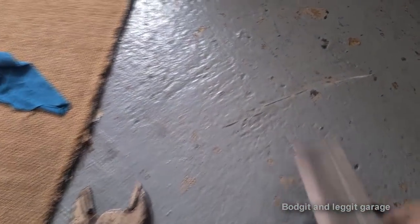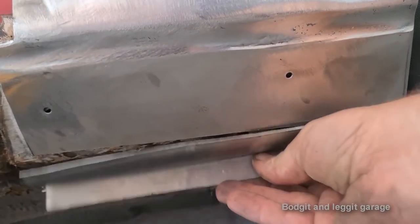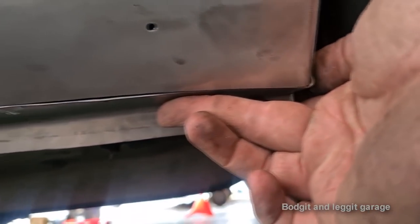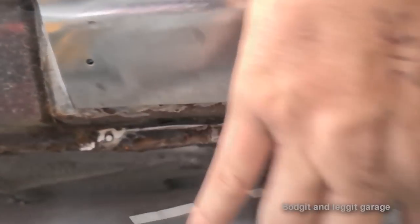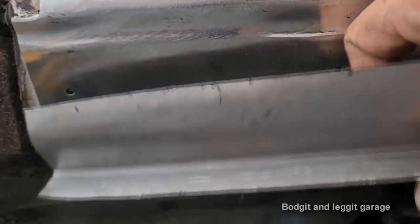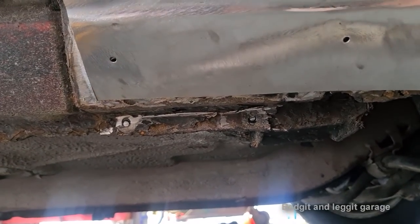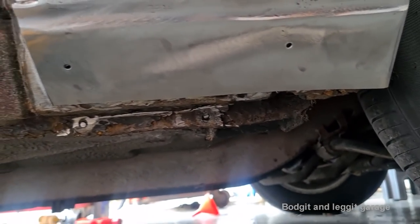And now, when we come under here, I do this, look at that. So once I weld that all the way across there, I'm blending our old edges there, we have our repair section. See that? So all I've got to do now is a couple of self tappers through here. I had to grind off them because they were sticking out and causing me an issue. So I'm going to put two self tappers through this where I'm going to re-drill the new bolt holes. So then I don't have to do any welding on here or on here, just make the holes bigger. But that will stick it into place while I weld this. Then I can take it off, weld it front and back properly, round my edge off. And then we can actually cut this panel to the size we need and start welding it to the car.